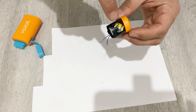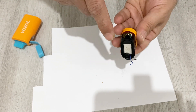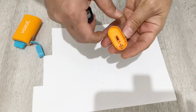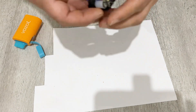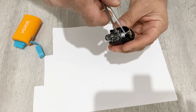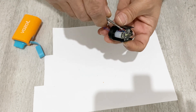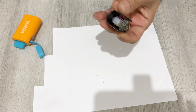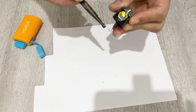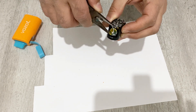Here I have a lithium polymer battery and a charging module. I'm going to use the charging module for another project and the lithium polymer battery for making my power bank. I have to be very careful removing the battery. This is the negative terminal — I'll cut from here. And this red cable is the positive terminal — I'll cut from here, then break this plastic part and slowly pull apart the battery.